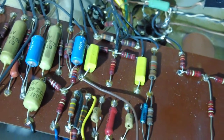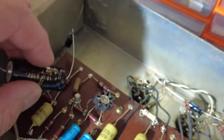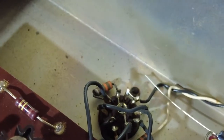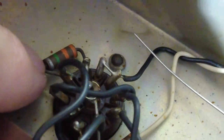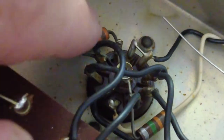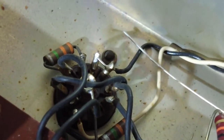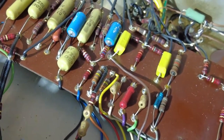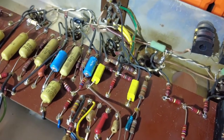I'm just going to hone through and make sure none of these resistors are massively out of tolerance. Remember I said these preamp stages are grid biased, not cathode biased — you can see those 3.3 meg resistors. Some of these were massively out of tolerance on the last one I did. There are two 3.3 meg resistors to check. We're getting through it now — we're a good way through. Hopefully soon we'll be firing it up, checking the bias, and testing the preamp valves.